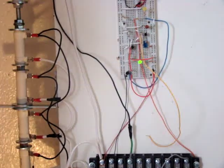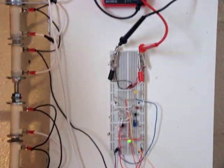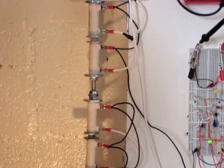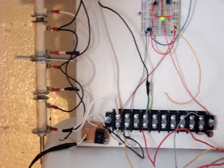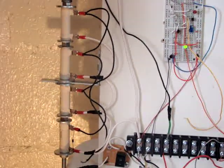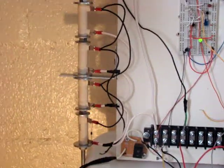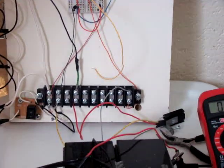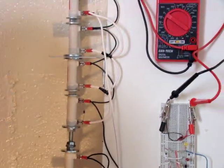Let me walk you through the circuit. On the left, you can see the power resistors connected in parallel, supposed to dump the excess current. I actually have two series — the first on top with four power resistors is the one currently connected, and the second series of four is not connected. So I'm using only one power N-FET to drive those four resistors on top.